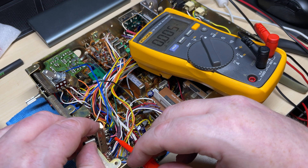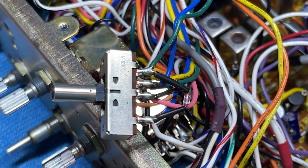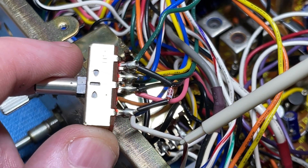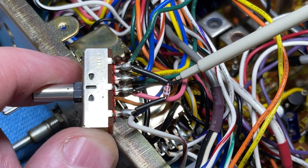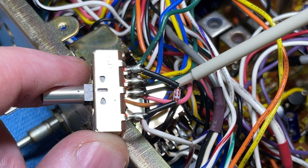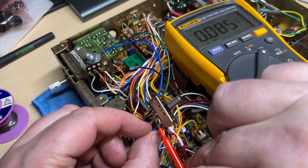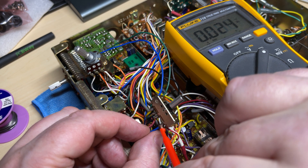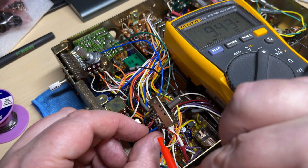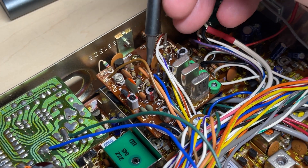One of the connections carries 13 volts for the highlight, which connects to the center wire, and there's a diode in there as well — so we need to try and recreate this on the band switch. The other side has the crystal wires for the actual bands. Because this is a 121 chassis, it's powered by a voltage rather than switching the crystals through a switch. So we find the common — there's the 9 volts — essentially applying 9 volts to one of these wires to enable the bands. We can safely remove those wires going off to the crystal oscillator.